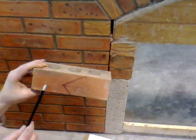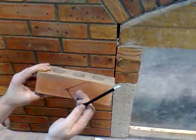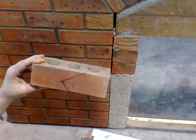Now we need to take this into the saw room and cut it with the clipper saw. Remember — always cut to the waste side of the line. It is better to make the cut too big as opposed to too small. That way, when we come back to building in, we can mark off any pieces that need to be trimmed off.